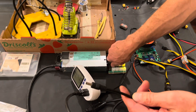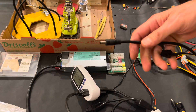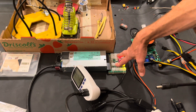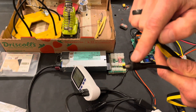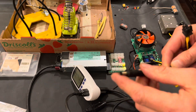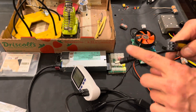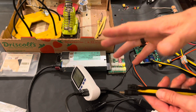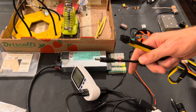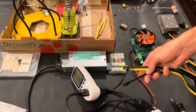However, this is not going to work if we update our firmware to 260 gigahash, because we'll be pulling 115 watts — that's about nine and a half to almost 10 amps over the server PSU. That connector is designed for 10 amps, so it will be at maximum capacity. Also, something in the KS0 shuts the system down and restarts the miner on 12 volts. I was trying to update six of my miners and only one actually worked on the 12-volt system — probably because it used slightly less power. All five others were restarting and not working.